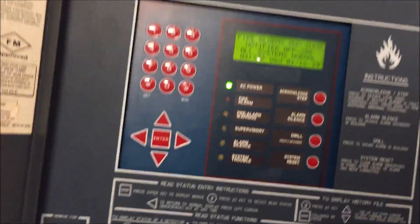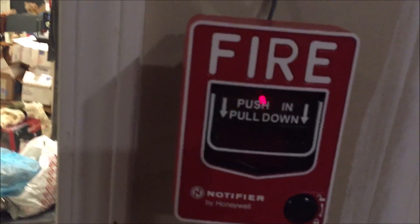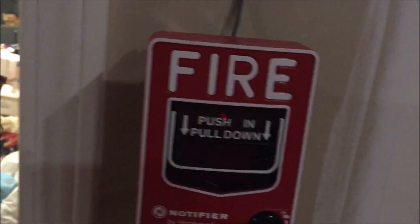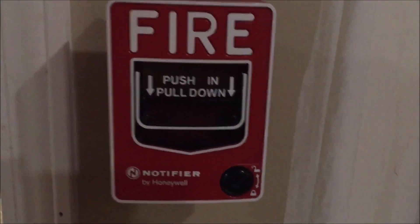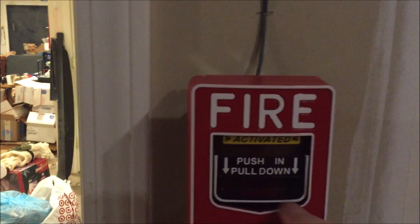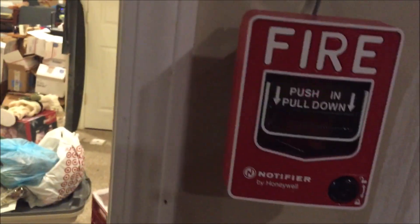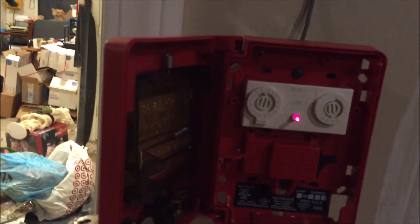Let's go ahead and pull the detector — you'll see a change in light state briefly as it sends the alarm ping to the panel. Because this speaks a different language than the analog panel, the lighting won't stay solid, won't change colors, and everything — so this is just how it's going to be because I have an older panel. Push and pull. You can kind of see it briefly — yeah, see, it's already in alarm; it briefly went solid as it sent the alarm ping to the panel. Here's what it looks like on the inside if anyone's curious — nothing special.